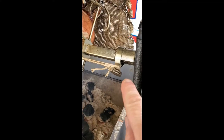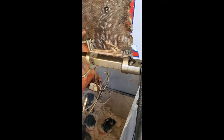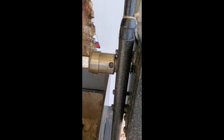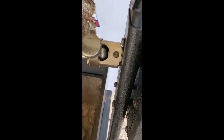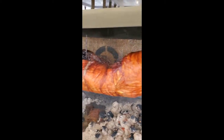A couple of other things: you'll see these connectors that are supposed to lock the rod in place, but from experience, the heating of the device causes the metal to expand and they come loose. So I've taken to tying them up with butcher's twine so that the rod doesn't pop out. Additionally, there was a small screw here which I broke several times, and I ended up replacing it with a hardened steel rod that's a press fit — you can see that right there.